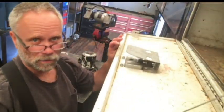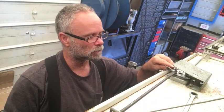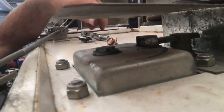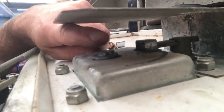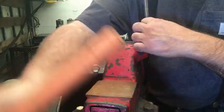We're back on site. I believe I was a little premature in assembling this. Went ahead and put it all back together and noticed it was binding pretty tight. I took a good one apart and studied the way it was put together. What I need to do is disassemble this whole thing, put the part I fabricated in through this way, then put the handle on, and then run the pin through while the handle is on the door. So we've got to take this apart — over to the vise to figure out how to line this up and disassemble the assembly.